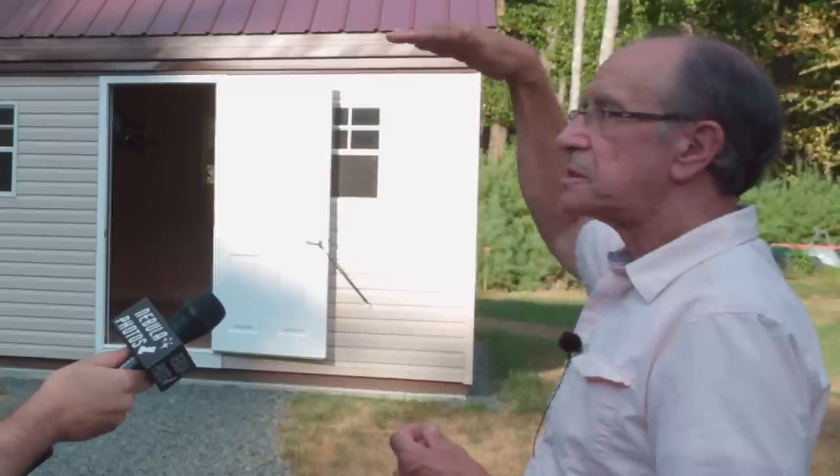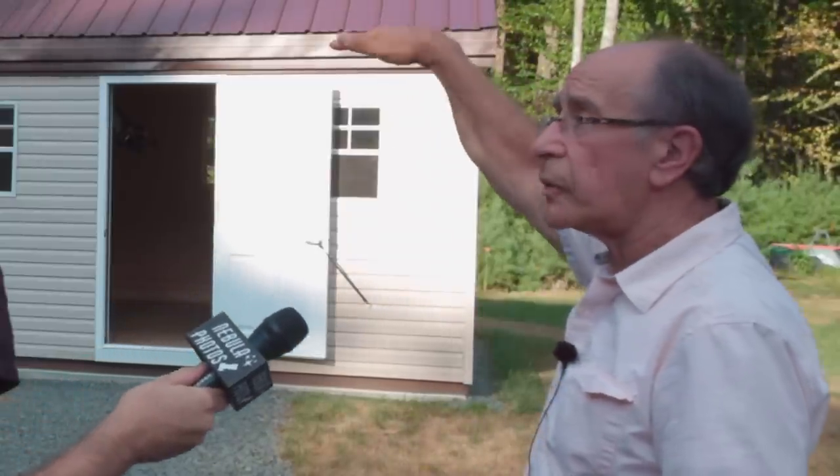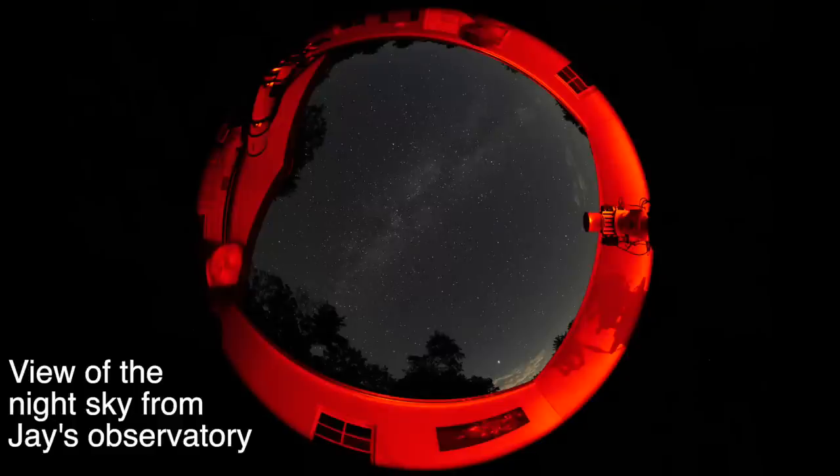You've thought a lot about this and seen friends' observatories, so you've put a lot of collected wisdom into this design. Is there anything unexpected that you regret or that came up? We tried to do as much as possible. You see the treeline around — my wife and I actually came out and used poles cut to the height where we knew the roof was going to be, so I could actually see from where the mounts were going to be what my line of sight was going to be to the trees. That's something I don't think people necessarily think about — line of sight over the top of a roof — because the worst thing to do is find out you built the walls too high and you've lost 10 degrees of sky.